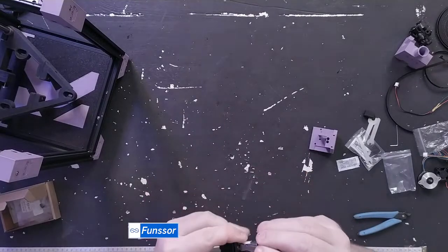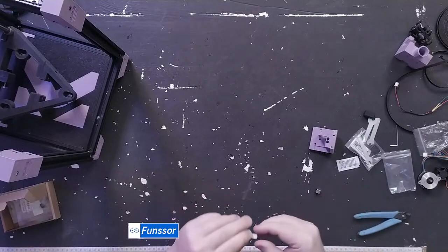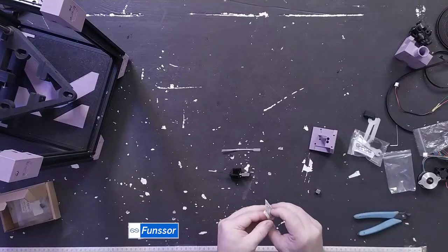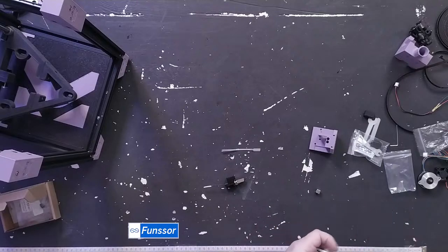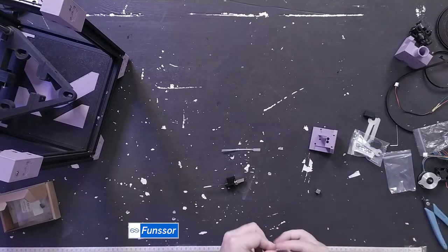Okay. Small little hole, put the heater element and thermistor on, then slide on the clip. There's a cutter for it. Yeah, I saw that. Glass bead goes in the hole. So I just need to put some thermal compound onto that thing. It takes some force. Thank you, that actually helps a lot. I was a little worried about how much force to use. But if you're saying that it's going to take a little force, then I'll use a little force. That's okay.